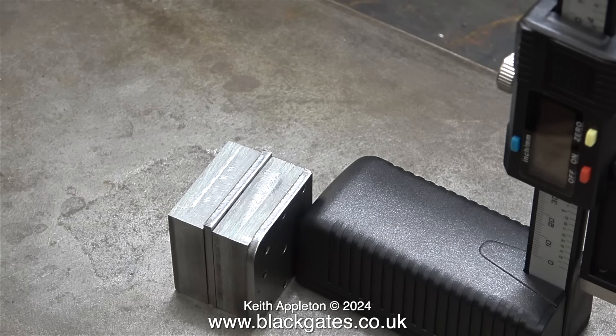And now you see the problem. The blocks are one-sixteenth of an inch too short from the top to bottom of the crosshead. But I'm really not bothered about this, because I don't like the position of the holes to start with — I think they're too close to the edge and they just don't look right. And 6BA bolts, for me, are a little bit small for this application. Making a pair of crossheads with a slightly simplified design to a good standard is going to take a bit longer than I thought.